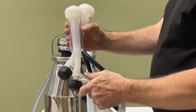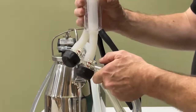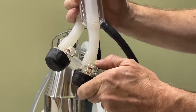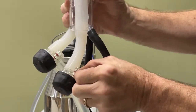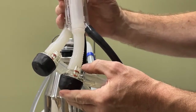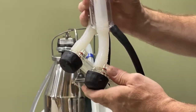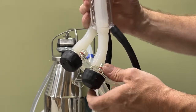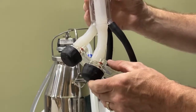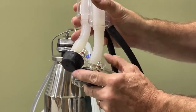They're very simple. I do want to talk just a little bit about these two little pins on these 205s. There are two small wash pins here that can be pushed into the down position or into the up position. And as you can hear, when you push them in the down position, it allows air to go in. That's during the wash, so during the wash cycle, the water will continue to flow. So these will always be in the up position for when you're milking, and then when you want to wash by throwing these in a bucket of soapy water, you will push these pins down.